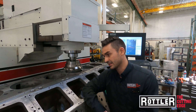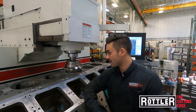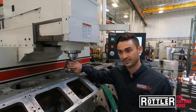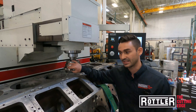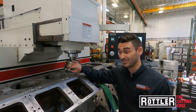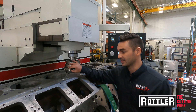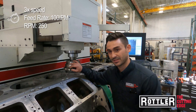So you're gonna have a pretty rough surface to have the weld kind of stick. What we use is our 8 inch shell mill — it has 13 inserts in it — so it's really just getting the material out as quick as possible. We can run this at 250 RPM and 100 inches a minute, and then we'll check it with our profilometer to make sure we've got the correct spec. So we'll let this run and see how we do.